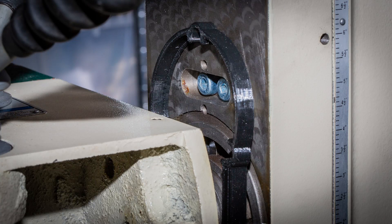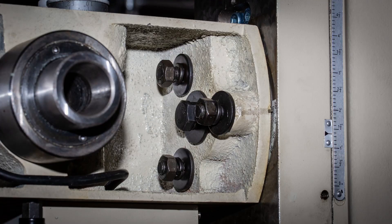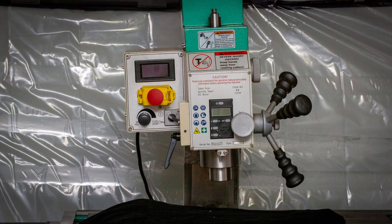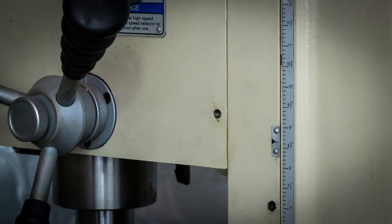The headstock is a snug fit onto the boss and requires some jiggling to persuade it into place. Once the headstock is in position, I reinstall the hardware leaving it loose enough to rotate the head. With the headstock secured to the slide, I rotate it into a vertical position and tighten down the mounting bolts, keeping in mind that they'll need to be loosened again to tram the head.